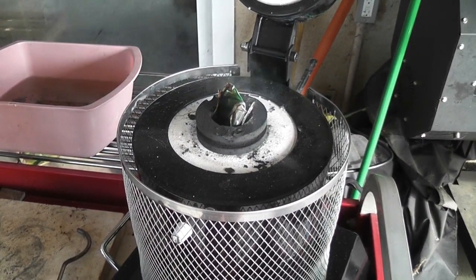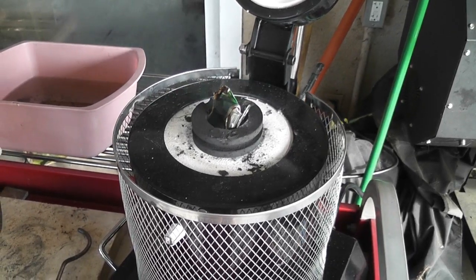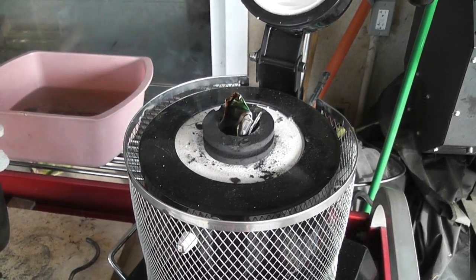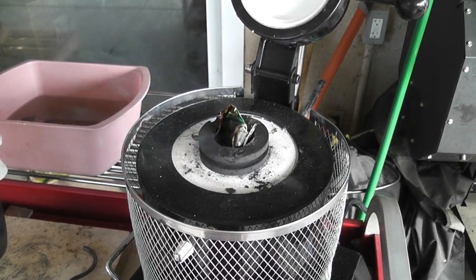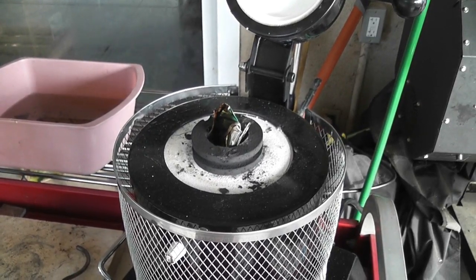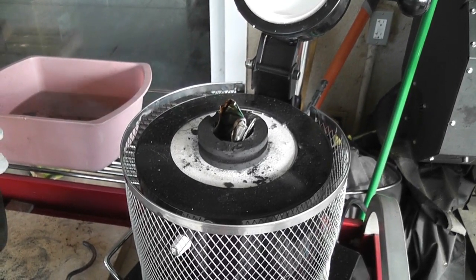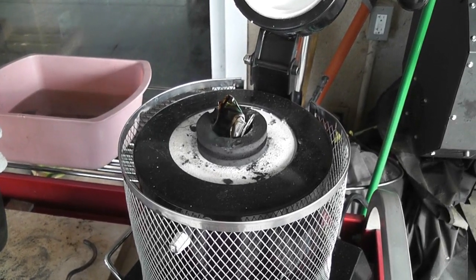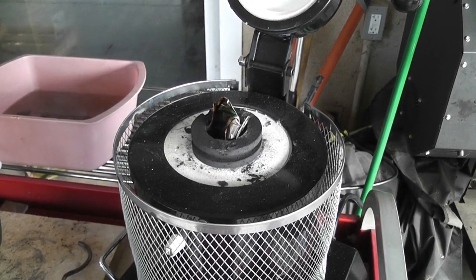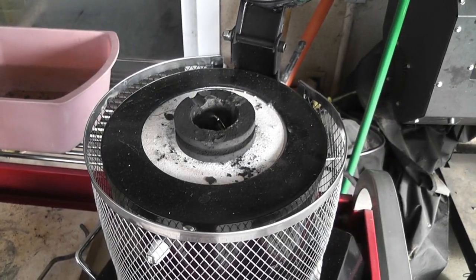This can I thought I had gotten to the right size, but not quite, so it's gonna melt down a little bit. It'll go down as it warms up and gets soft — it'll sink into the crucible. See all the smoke coming off it? That's what you get when whatever's left in the can burns off. They use something to print on the can and you just don't know what chemicals are involved, which is why ventilation is important. From time to time you can see a flame shoot out, and then as it gets hotter it grows softer and softer, collapses and sinks down into the crucible.